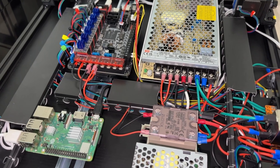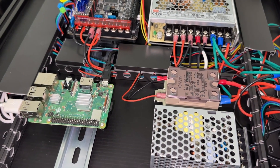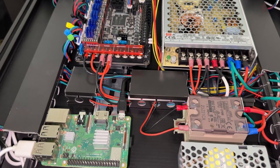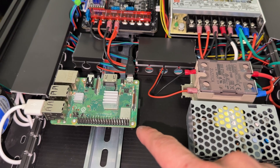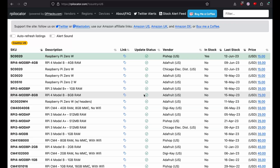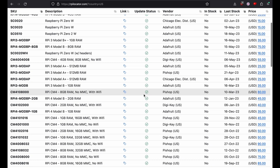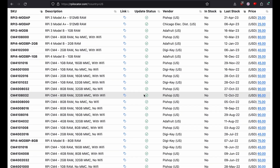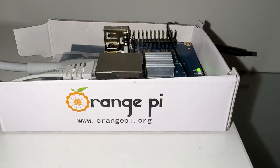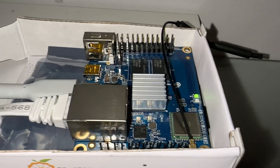The tenth video was mounting the electronics, end stops, and bed. The big mistake is not being careful handling sensitive electronics and shorting something out, especially the Pi. You can't always see the ESD spark. At the time of this video, it's still hard to find a Pi without camping out at this website — I have only seen the 3B Plus twice in three months. Fortunately, there are alternate boards such as the Orange Pi, though I find the quality of the Raspberry Pi to be slightly better.